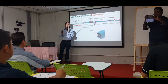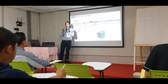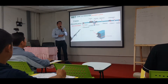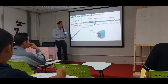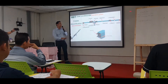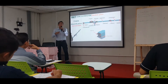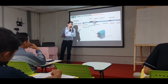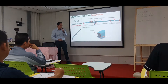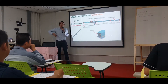In the bus bar system, we divide it into single-line and multi-line. When the maintenance team wants to replace the bus bar line, they need to know what type of bus bar is installed. You can differentiate them from the enclosure or the overall outlook. For multi-line bus bar, inside the enclosure there is more than one copper stripe, which is used for contacting the power supply.